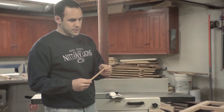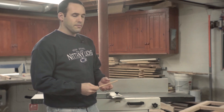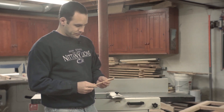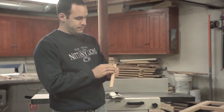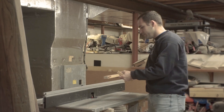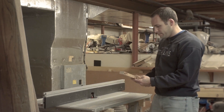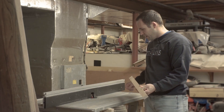To make the bead molding to match my face frame, which is cherry, I knew I'd have to make it because I couldn't buy cherry bead molding — I couldn't find any bead molding for that matter, let alone cherry to match since I want to do a natural finish on the front of my router table. The first thing I had to do was get a nice clean edge, which would be on the inside of the drawer front. I first took it over to the joiner and got a nice clean edge, then came right over to the router table and ran it through with the bead molding bit, which has an eighth-inch radius on it, along the bottom edge of the board. It really cut really nice.